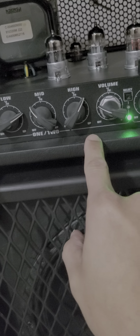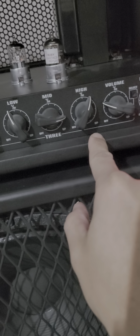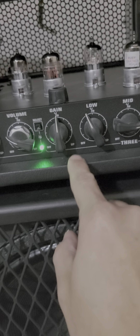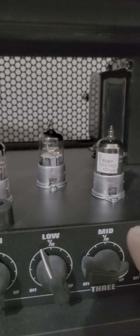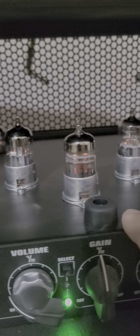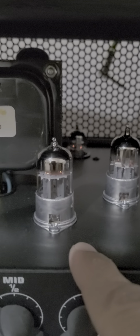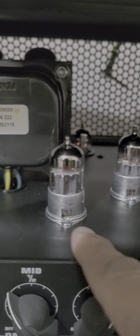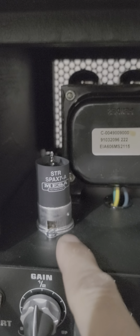This is channel 3 — it's now usable. You can max the gain and increase the volume without having a lot of feedback. So there it is: Ruby 12AX7s in positions 3 and 4, Mesa Boogie 12AX7 on position 6, Electro-Harmonix 12AU7 — this one's very, very good — and the Boogie SPAX7 on the V1 position.